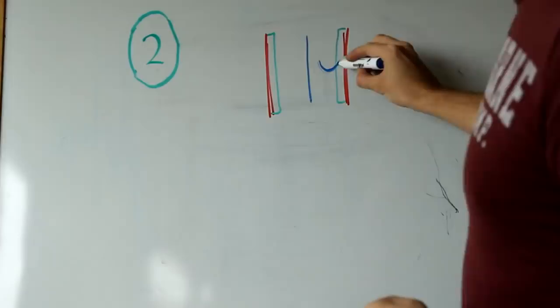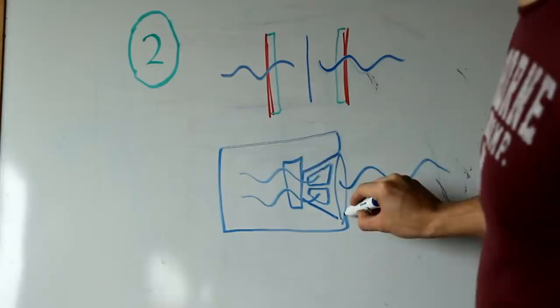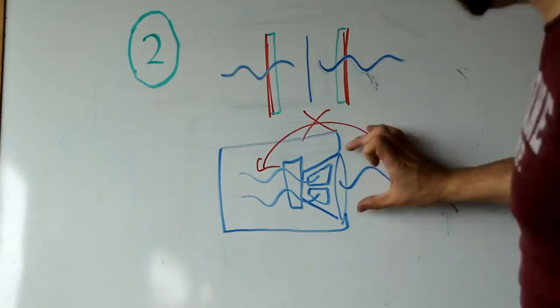You may have noticed that I mentioned these speakers excite air both in front and behind the diaphragm. This is in the same nature as a conventional loudspeaker driver, except that the waves emitting from the rear of the cone are isolated by an enclosure, normally, to prevent them wrapping round and cancelling the desired waves coming from the front. In order for this cancellation to occur, usually the waveform needs to be long enough to reach around from the back of the driver to the front, which means that without an enclosure, the usable low frequency response is defined by the physical dimensions.